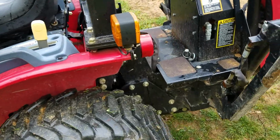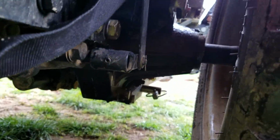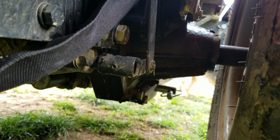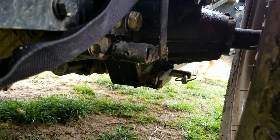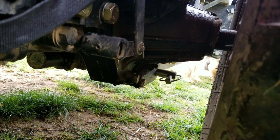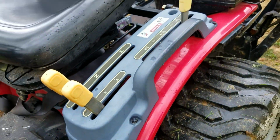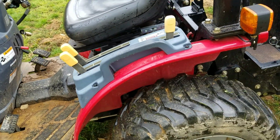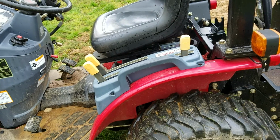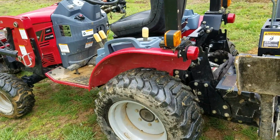One of the big things was, I don't know if we can see this or not from here, the rear, right there, the wheel seal started leaking on this thing. And it started leaking hydraulic fluid all the time, dripping everywhere. So what I figured out is lower the fluid level down, jack the tractor up so it's leaning, pop the seal out and put some sealant around the outside of it, push it back in, make sure everything's all cleaned up, and let it cure, put it down, and refill the oil, the hydrostatic, the transmission hydraulic fluid.